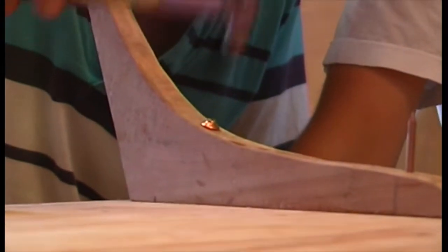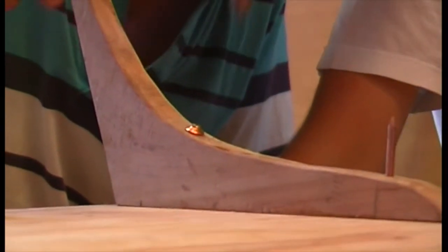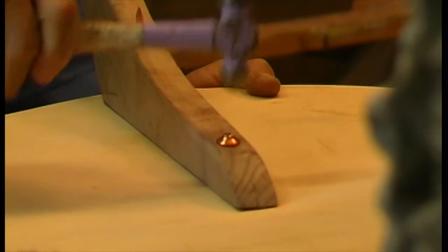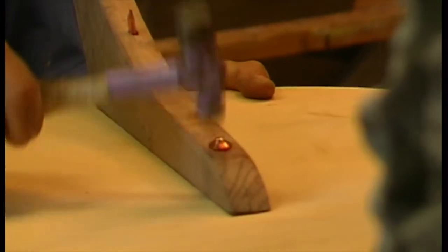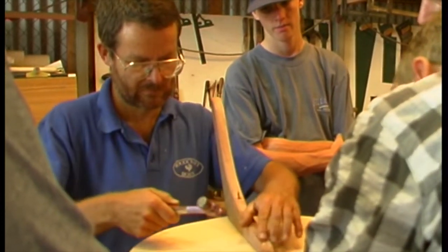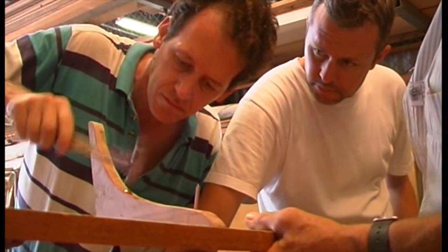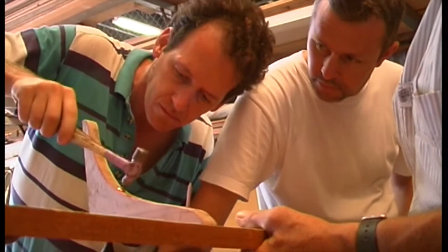Aim to hit with the hammer ball dead centre on the nail — this forces it to spread out. A nail this size should take around 30 to 40 rapid hits. Finish with some tapping around the edge to flatten out any sharp bits. The hammer used should be the lightest that will do the job, as a too-heavy hammer is likely to bend the nail inside the timber.